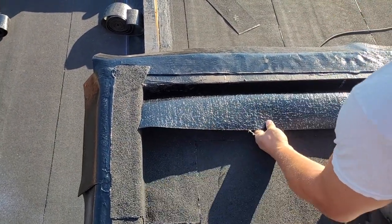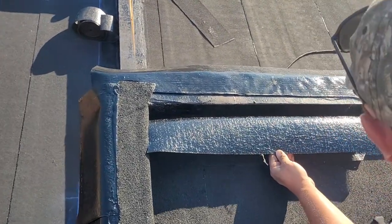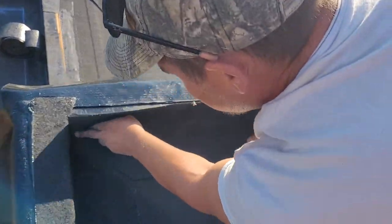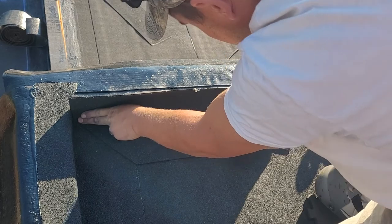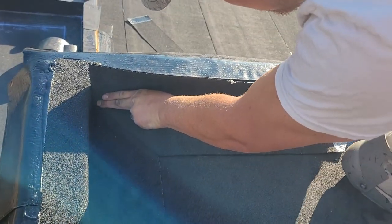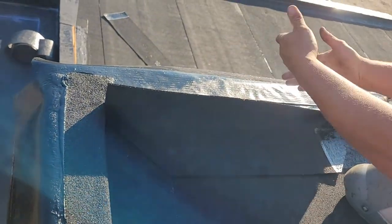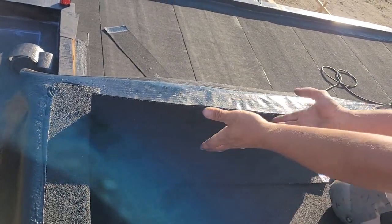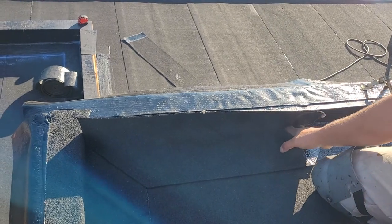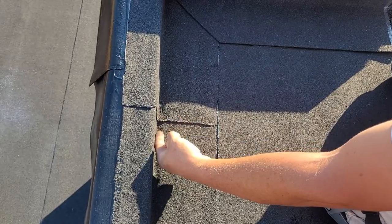Pointing my torch away. I'm in there quick — you see how quick I was? Just blast it and get in there. There's enough heat to get it stuck. This first one is just to set your piece in place and then you torch around it. This first one is just to get this transition, which is the most important part on stripping. What leaks is when this isn't tight and water is able to get into the lap.